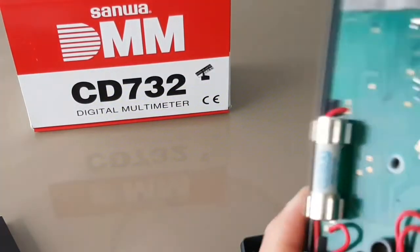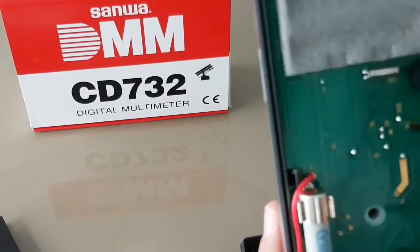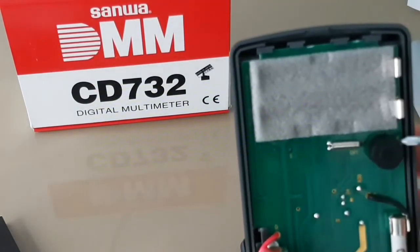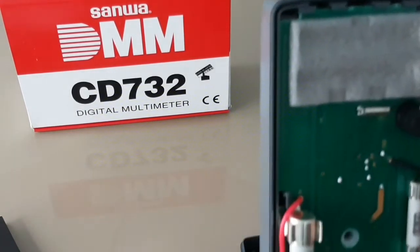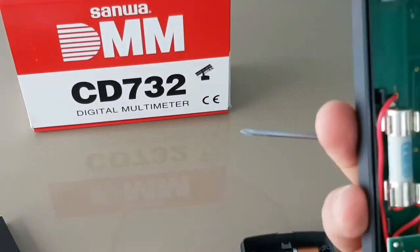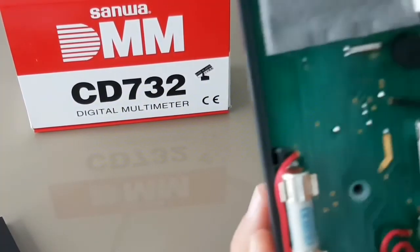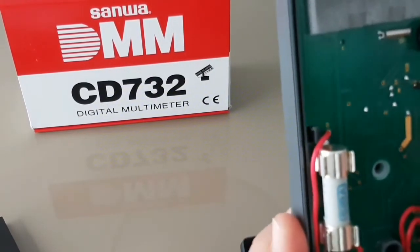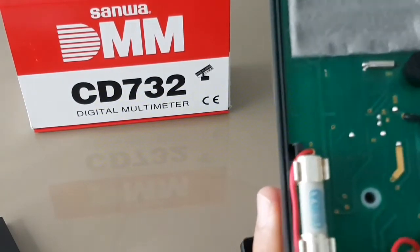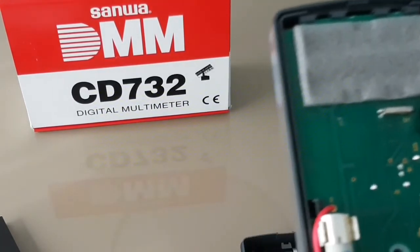You've got a nice Siba fuse — it's a 16 amp Siba fuse, so you're getting 16 amps worth of input protection. There's also a PTC here, and another Siba 400 milliamp fuse. There's the speaker, a crystal on top, and the brass insert is visible inside. The IC here is the FS9922-DMM4 from Fortune.